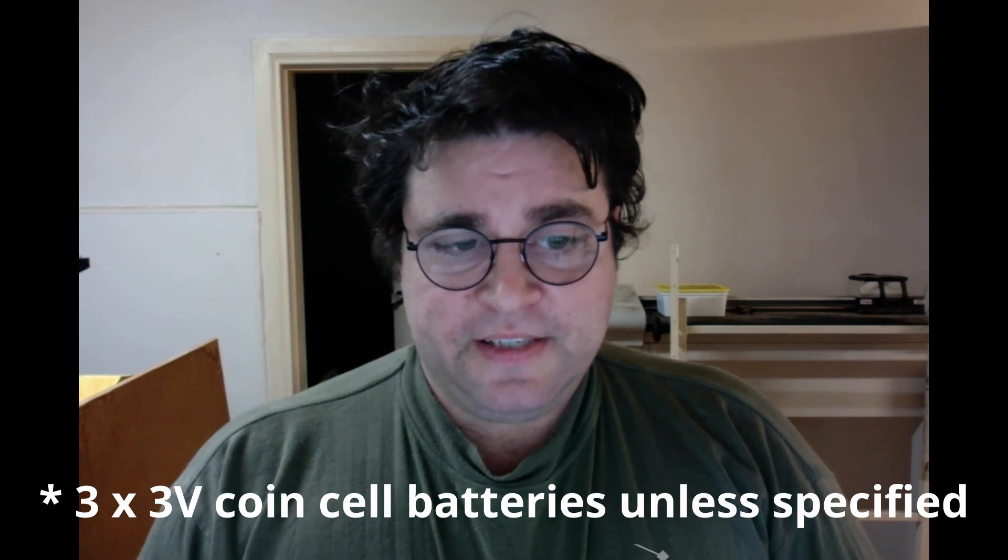In the original Funway series the 9V battery was a common power source. For my modernised versions I have decided to go with 3V coin cell batteries, as it provides the same amount of energy as the old 9V but it's far more compact and the holder is generally mounted to the opposite side of the board, which keeps the space taken up to be minimal. One of the benefits of these 3V batteries is they are lithium based, so they have roughly the same amount of current or milliamp hours that the 9V batteries have, and they are in a nice compact click-in holder.